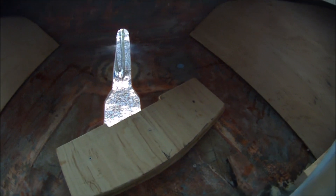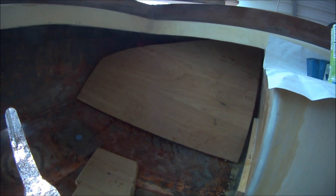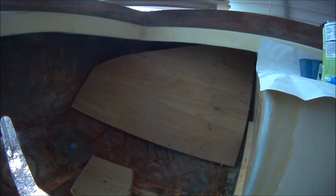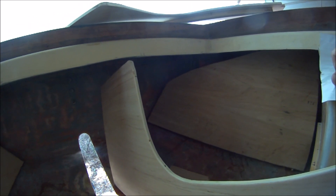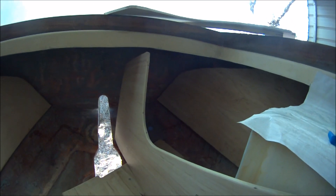I've glued these two pieces of plywood together so they're ready to go. These gas can shelves have been coated with epoxy resin on the bottoms and then slid up and positioned vertically so that there's clearance to put in these vertical panels. Then I'll be able to drop those boards back on top once this is glassed in — otherwise you can't get those boards in place with these in first.